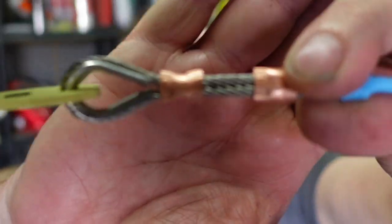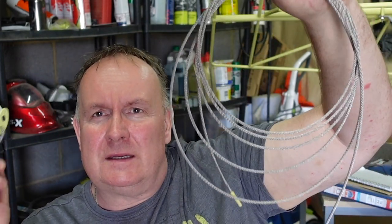I decided I'm not going to stick with that. I've got to remove them — a bit of careful work with the Dremel. They're copper and fairly soft, so I should be able to get them off without touching the steel wire. I've ordered a proper swaging tool and more ferrules. I broke another of those cardinal rules — the first was don't buy cheap tools, and the second was don't take shortcuts. And I did, and now I regret it. That's slowed things down by several days, but we'll do the rudder cable properly.